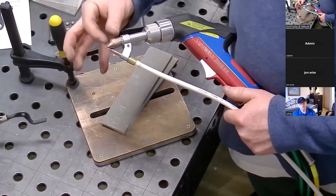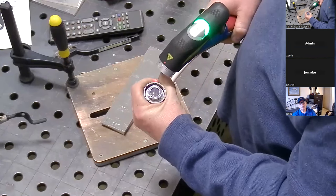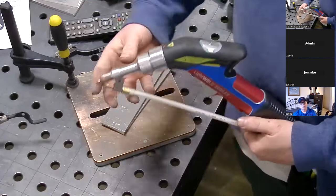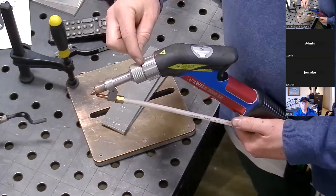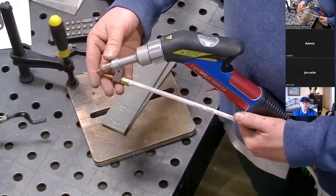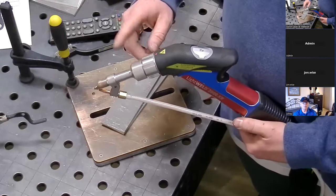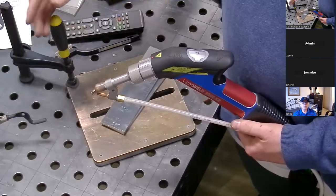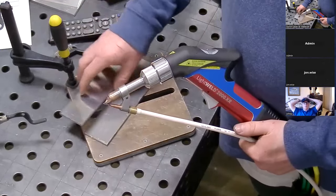When you're fusion welding, you're directly dragging on the surface, so it will eventually wear out, but not very fast. These copper nozzles are about $50 a piece. There's also a cover window — that little piece of glass — that's a protective window that keeps contaminants from reaching the focus lens of the welder. This window is about $15 and replaced on an as-needed basis. If it's dirty, you'll want to replace it. I'd get in the habit of doing routine cleanliness checks because if it's dirty, it will affect performance. Some aerospace companies have a schedule where they replace it once a day or more or less often, depending on how much contamination is coming off what you're welding.